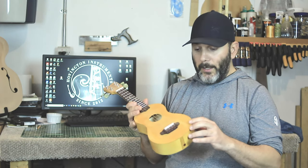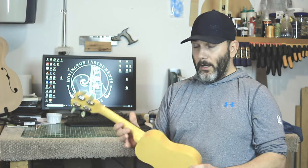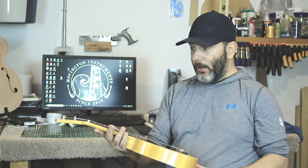I answered quickly saying you can use a two by four. Some of you may remember the ukulele I made — a flat top made out of a piece of quarter-sawn spruce — where I got all the material for the sides, top, back, and neck from the same two by four. It's decent sounding, not the greatest, but we're talking about practicing. Right now it's pretty hard to go to the lumber store, so if you have a leftover two by four, just use that one, although quarter-sawn would be preferable.